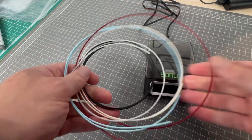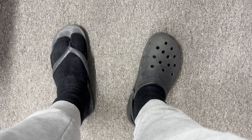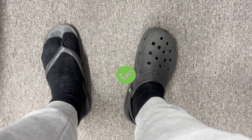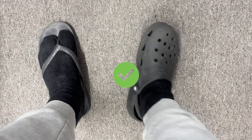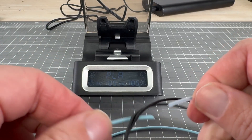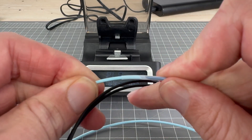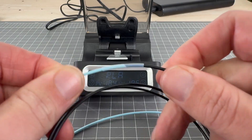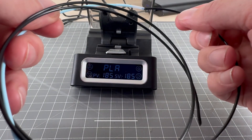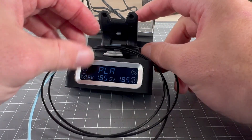We're going to test with a few different brands and colours of PLA. Remember when fusing you need to have the same plastic type — you can't fuse PLA to PETG. You may need to cut your filaments on an angle. When you slide them into the PTFE tube they need to mate properly without any gap, otherwise you won't get a good bond. I was having a bit of trouble to begin with using small pieces, but I got the hang of it. With longer pieces on a spool there won't be as much issue.